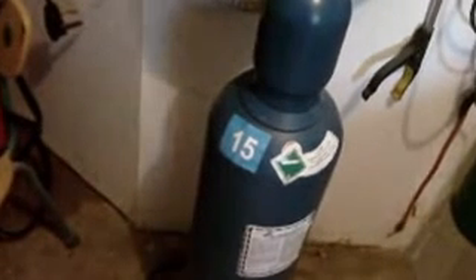When I put the bottles in the vehicle, the professional welder I bought them from was there. I showed him my little Lincoln 180 and he said it's a good machine — he said you should have lots of fun and good time welding with it, so he approved of it. If you're thinking of getting a welder, keep in mind this is not a 110-volt — it's a 220. You need a dryer outlet or a 220 plug to operate it. The advantage is more steady power. It's a little more inconvenient, but I don't intend on taking this out in the field. If you do, you can use a generator of 7500 watts and it'll run this anywhere you go.